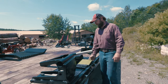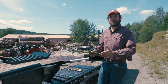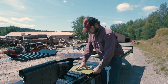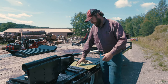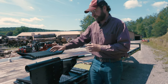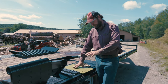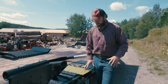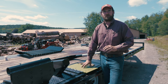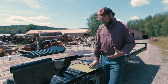Over here, we have our oil impregnated nylon. This is actually what prevents any metal to metal contact with our steel. So this sits underneath our push block and on top of our beam. These holes here are for grease. So you're putting grease through your grease zerts here, and then that's actually getting absorbed by this nylon, and that slides on top of our beam, minimizing friction and reducing wear. This is a sacrificial wear component. It will wear out over time, but you'll never get metal on metal wear. All you have to do is replace this, and you have basically a lifetime frame.